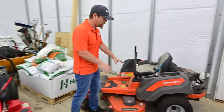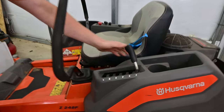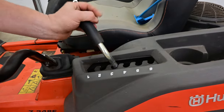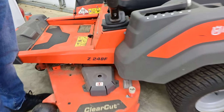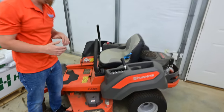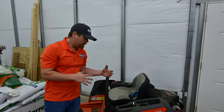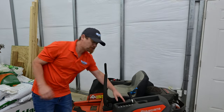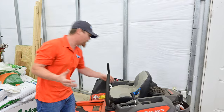This is actually the residential mower, and you can see the cutting mechanism here. We have this one through six that's labeled here, and this lever actually raises and lowers the deck — this is how you set the height. We have a lot of customers and people who think that this one through six mechanism is inches. They think if I set it on number four, I'm cutting at four inches, which is what we recommend as a minimum height for fescue lawns.